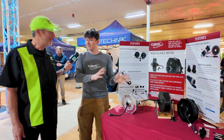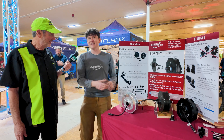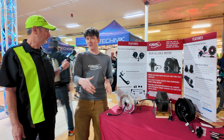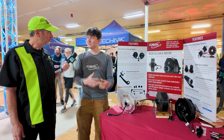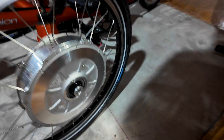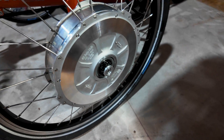The other thing related to hill climbing is that in a hub motor, because you're geared naturally by the size of the wheel, when you go to a smaller diameter wheel you get substantially better performance. Because recumbent bikes especially are prone to use 20-inch wheels, a hub motor does way, way better than it does on an upright bike where 29 inches has become the norm recently.